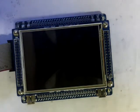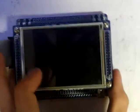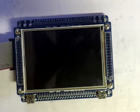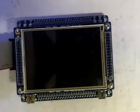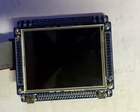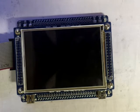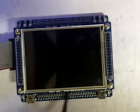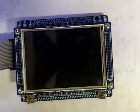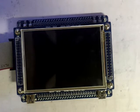It would break out the GPIOs and have a battery system. Talking about batteries — it's been a tradition for all LOS versions to be able to run off a 9V battery. I'm getting to that. Right now I'm using a random USB power supply from some old MP3 player, which is probably broken, but it's a 700mA supply so it's definitely going to be able to power this thing. I'm still working on the 9V solution because I haven't soldered anything to this yet. I shall strive to make every LOS version run on 9V batteries.